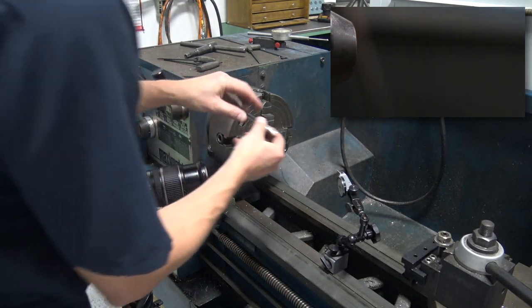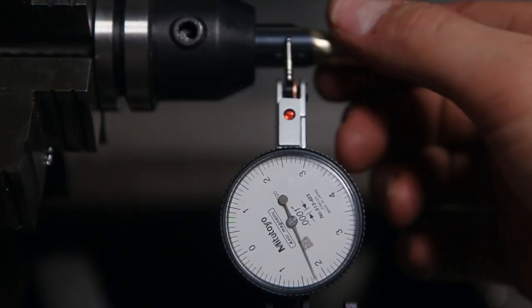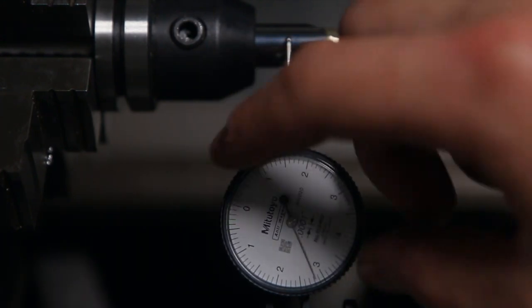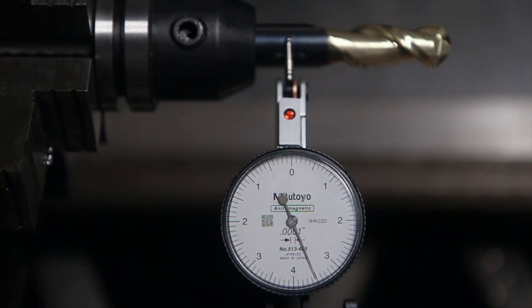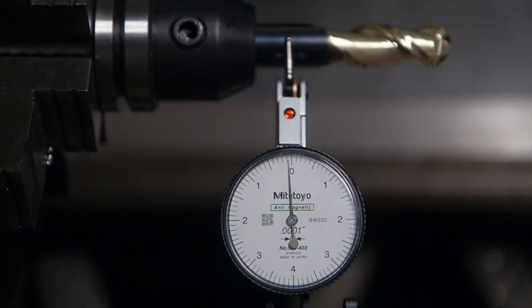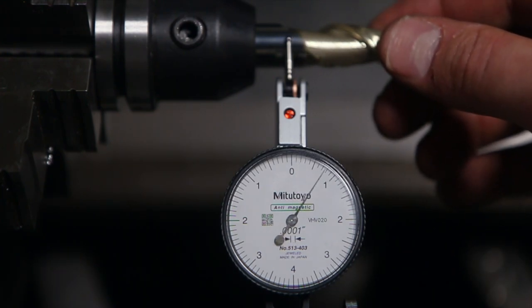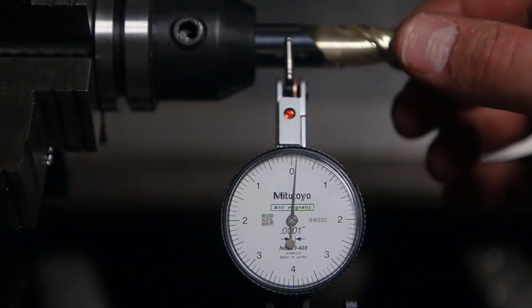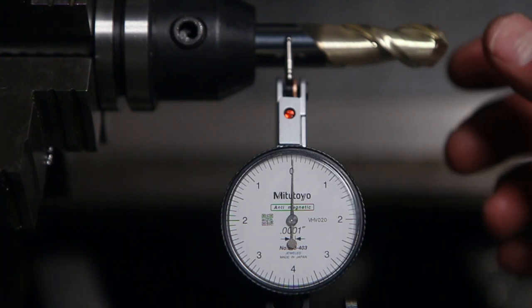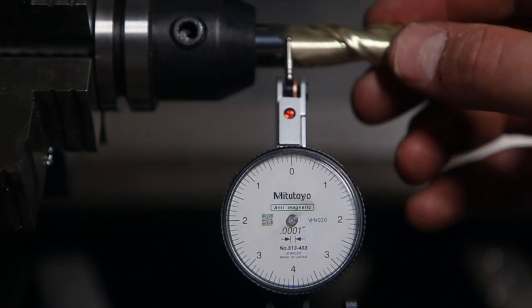Lake Shore Carbide half-inch ball rougher — let's just slide it in first. So loose end mill, let's just preload it. It's just so smooth and so nice compared to a clunky old thousandths indicator. That would tell you there's potentially up to seven-tenths of runout — going from two-tenths up to nine-tenths. But remember, we had about one-tenth measurable runout when we started.